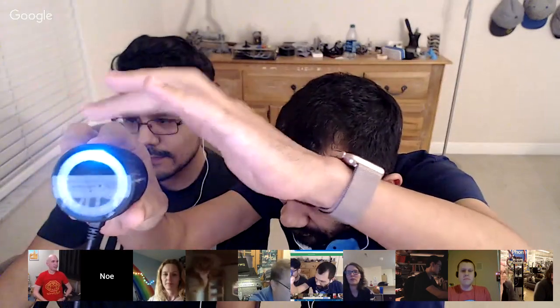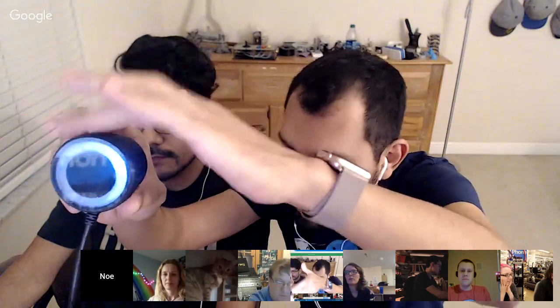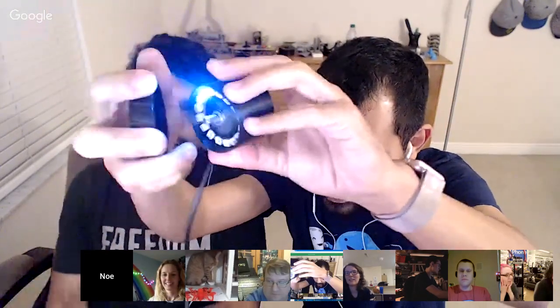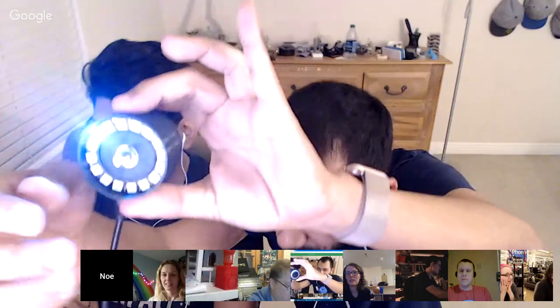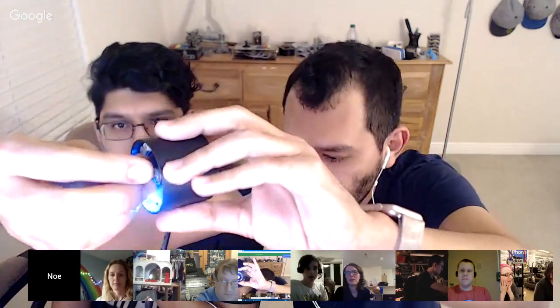Next up, Noah and Pedro. So this week we have a 3D printed media dial running off CircuitPython. There's a Trinket M0 on the side there, and you can use three functions. Right now I just have it controlling the brightness on the screen — you can see it dim and then brighten back up. And then there's an escape button, which I won't push because I think it will log me out of Hangouts. It's a super easy dual-extruded design. All the files are available. On the inside it's just a rotary encoder with a NeoPixel ring to display where you are turning. Super granular, so really good to control your timeline when editing video or long documents. You can make it do anything you want — it's pretty quick to look up the key codes and change them to make custom macros.